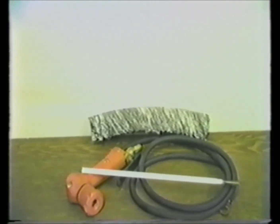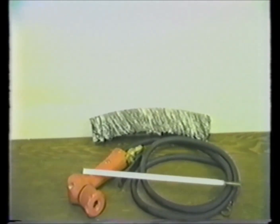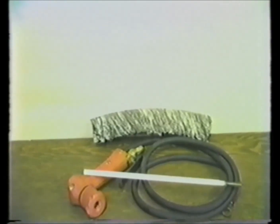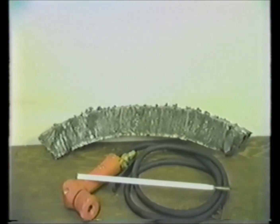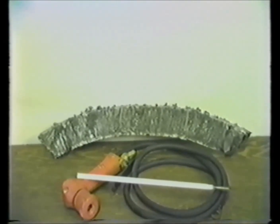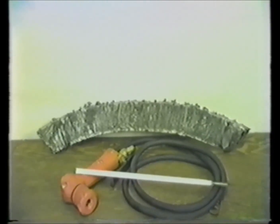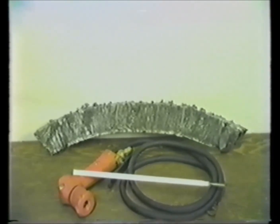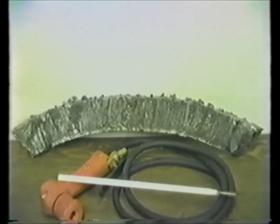Penetration gives you a little bit of control and lets you work against the steel. When you've got a very slight penetration, you can travel faster, but you're on the edge of losing it. This is a piece of two-and-a-half-inch steel. You can see the rod groove at the bottom. Over on the left, you can see where the rod was walked around the corner — instead of rocked around the corner — and that edge was burnt out.